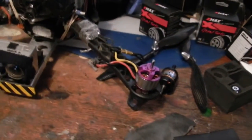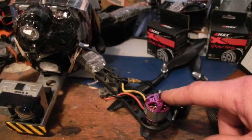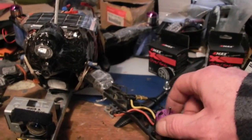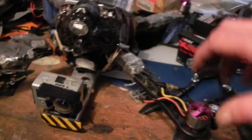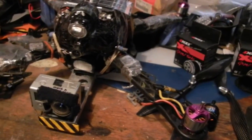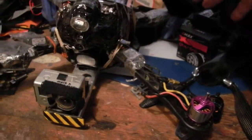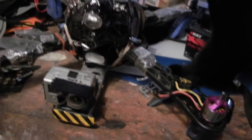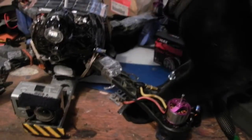Should be a neat experiment. I got four fresh motors, and if this works these motors will go into the carbon fiber frame, because I just had motors in there that were all beat up and weren't working properly. This is a fresh set that I know works, so if I put this on the carbon fiber quad with the other free flight board that's been tested, they'll work and I can eliminate one more thing causing the issue with that quad copter. It may be the Plush 30s — if the motors work fine on this quad but don't work on the other quad, then the Plush 30s aren't calibrated properly.